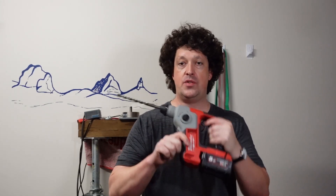On my other channel, Bolter Down Under, I do more quantitative kind of testing. I did a runtime test in granite — the test was a five amp hour battery drilling 12 by 70 mil into granite. So that's your size for doing your normal sort of sleeve anchors.